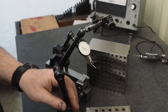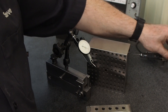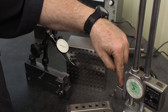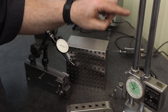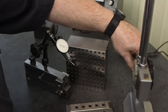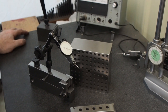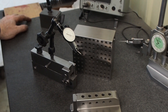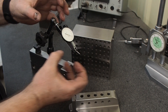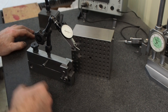With other style heads on a Noga arm, I've actually indicated things in on an OD grinder and I would get it so the indicator would read zero. Just for kicks, I'd set up a solid setup with the Mitutoyo height gauge, use the same indicator, and check what I'd just zeroed out - and I've had them out up to five to ten thousandths of an inch depending on how worn and sloppy they are. I'm a big fan of Noga, I'm not knocking them, I just know their limitations. When I go for accuracy I use the non-adjustable arm because I want everything tight and to repeat.